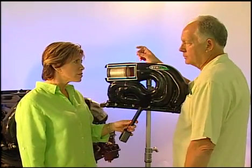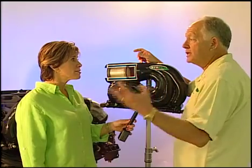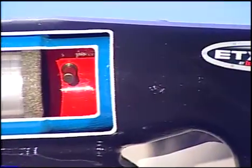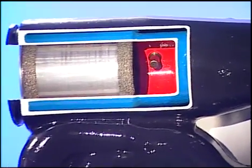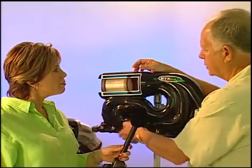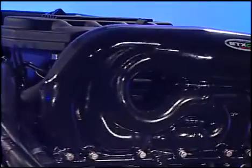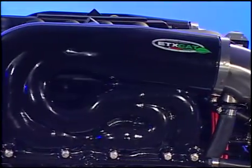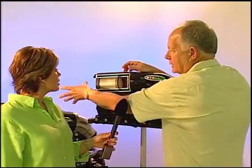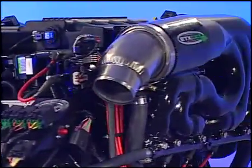We use a ceramic substrate. A lot of people are using metallic. Again, metallic doesn't like salt water, corrosion. We wanted to eliminate all the water joints that we could, so we didn't have leakage into the O2 sensor, into the catalyst. So our manifold's a one-piece unit. There are no seams, there is no water coming before the catalyst. It's all injected after the catalyst in the stainless steel dumps that we saw earlier, if you remember from the line.